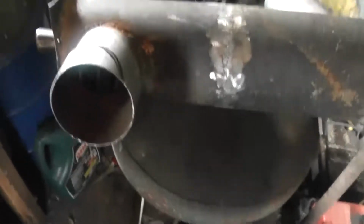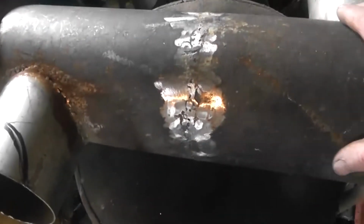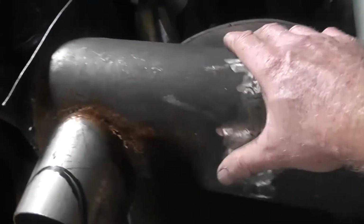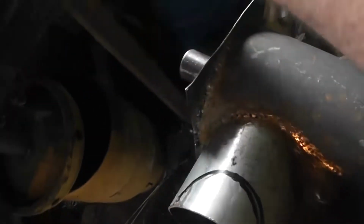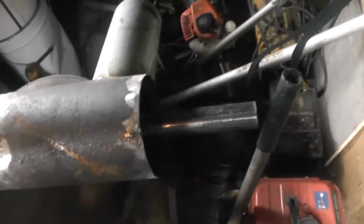Now, in terms of danger, people will panic saying, by Christ, you can't have the air sitting around the exhaust pipe, and if any fumes get in, we'll all die. I know that. But what's good is, this is positive pressure in here. You're pumping air in, so it's going to be increased pressure going out. This is sealed. So any fumes that are escaping around here, how are they going to get into a positive pressure environment to be blown away? And as to the end of the pipe, when I put that cap on, I just have it going up away from it.